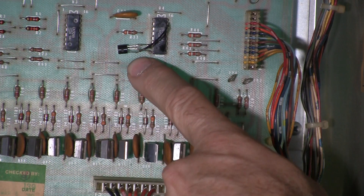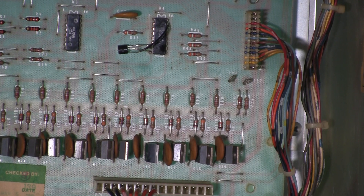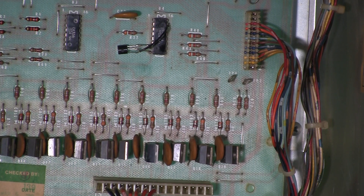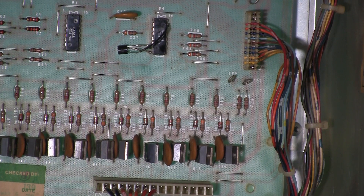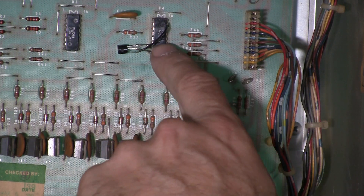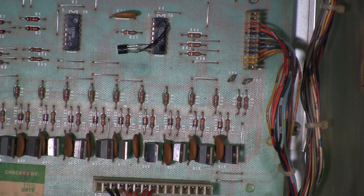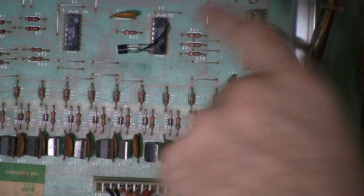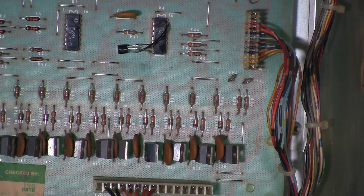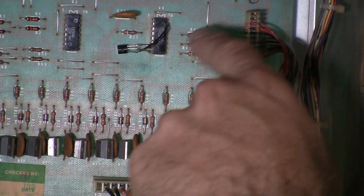So what I've done is jacked a transistor into this array. It's ugly — it's the kind of thing an operator might do on location — but it does work, and I just wanted to see if I could do it. If I was really restoring this game, I would obviously completely pull this chip out, put a socket in there, and drop one of those CA3081s in. But in this case, I believe the only pre-driver transistor used in this chip is just that one, so I don't even really need to replace the whole chip.